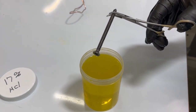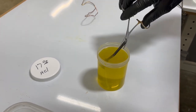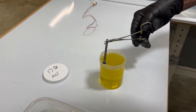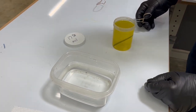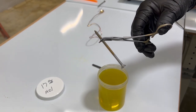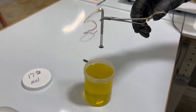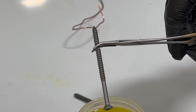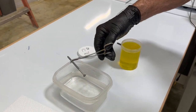We're just checking to make sure that this part is ready to begin the plating process. Obviously take your safety measures — make sure you're wearing your gloves and safety goggles and that you have a tool to pull out the part from the solution. Once we've deemed that it is ready, we will probably put it through two different rinses before we begin the electroclean process. If you do get rust on it, you can easily remove it in a matter of just seconds with a quick hydrochloric dip. That cleaned up right away, so it's just important to do each piece and go from one step to the next.